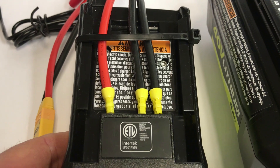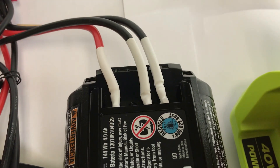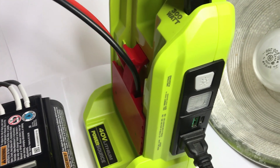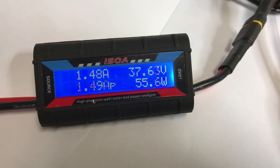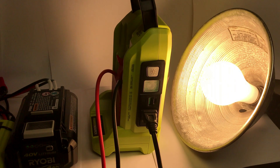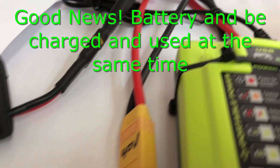For the test, I've carefully connected wires to the plus, minus, and the T1 temperature sensor, and I've also done it on the battery. They're tied together and go over to my 40 volt adapter that goes into a 300 watt pure sine wave inverter running a light bulb. I've plugged the power brick in and you can see we're charging at 55 watts. The charger is blinking green, the battery is blinking green, and the inverter is on with a 200 watt light bulb running — still charging the battery at 52 watts.